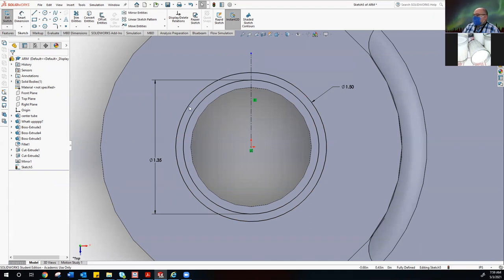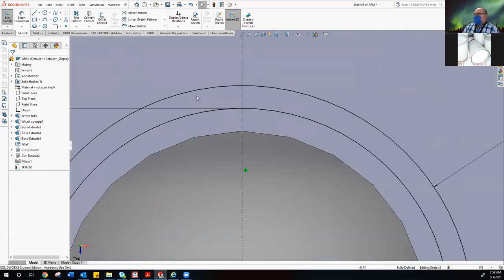Let's zoom in a little closer. I've got the center line and my two circles drawn today plus the hole. I need to look at Detail A up in the upper corner, which has a 5x in parentheses on it — that means there are five of these gears going around. But wait — there are nine. Why does it say 5x? There must be an error on our drawing.